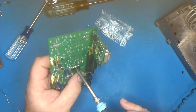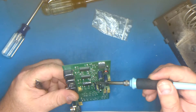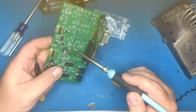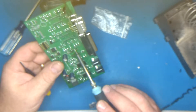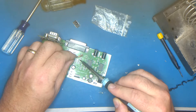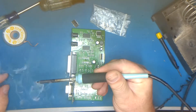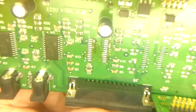Let's go back and forth gently. Hopefully it just pops off. There it is. Finally. And this cleans right up, just like that. I could use a little wick, but I probably don't need to. There's all sorts of action going on in the neighborhood tonight on the scanner too. I'll get a little bit of ChipQuick off — that way when we apply regular solder back on, things will be back in order. It's pretty clean. Looks pretty good, pretty clean.